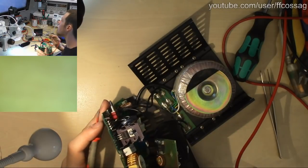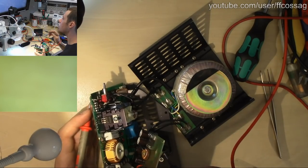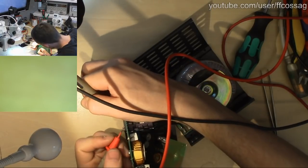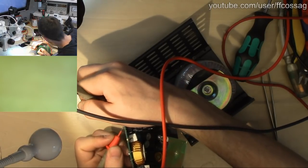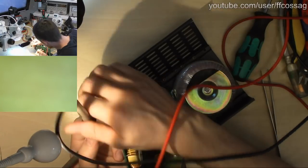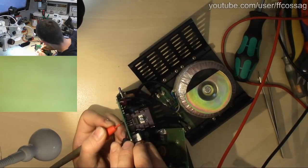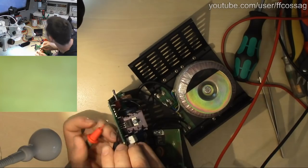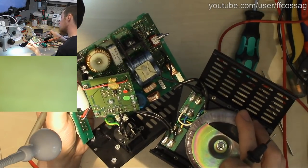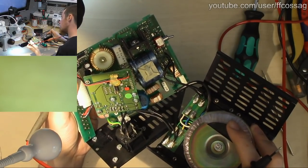Let's see, we have the anode is pin 1. Pin 1 is towards me, so this is going to be measuring the diode part, and that's measuring 0.5, which is within spec, but if we measure the other way, we'll get 0.1. Am I really doing this right? Pin 3 is the anode. No, I'm not doing that right.